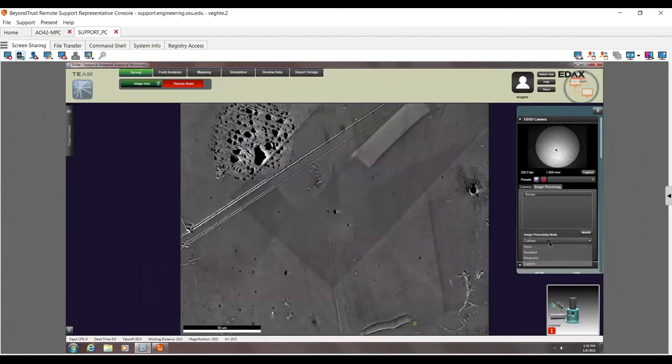Go ahead and turn this background on so we actually can see the bad background. This is a bad background, and this is where it gets tricky to know if you have a bad background or not. Notice that my beam is currently stationary, and I took a background while it was stationary. So I have my raw signal, I have my background, and I'm subtracting that background from my raw signal. I'm subtracting itself from itself, so it gets rid of it.